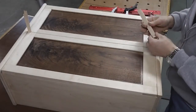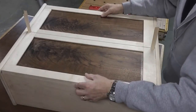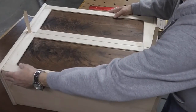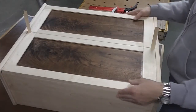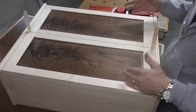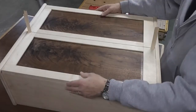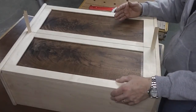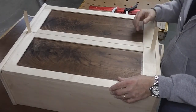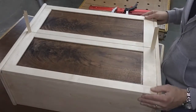So I'm going to use two of these shims. Put those in there. I've got a little bit extra on this side right here while I'm nice and flush on this side - and that's a good thing. What I'll do is start working on installing the knife hinges on the doors. Once those are installed, it's going to be a painstaking process, but I'll go through and start trimming the insides of these stiles with a hand plane to get them nicely square to one another and get that perfect 16th inch gap.